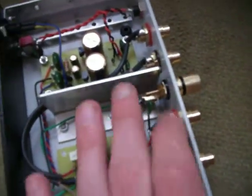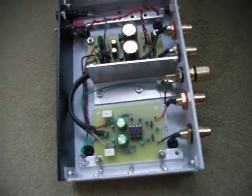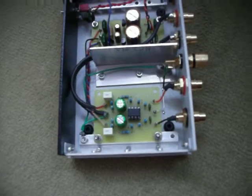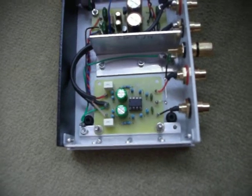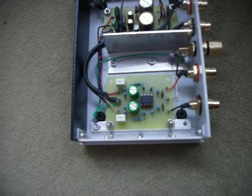I've got all of the inputs on the other side of the shield, and that's where it really matters. It's got about greater than 40dB gain — it's just written there in pencil. When I calculated the resistor values I designed this thing from scratch, so I put 100k and 10k in the feedback loop and that seemed to work fine. 40dB is just about right for this sort of thing.